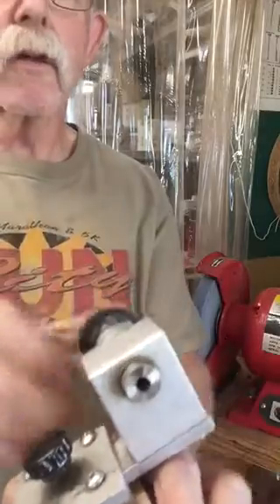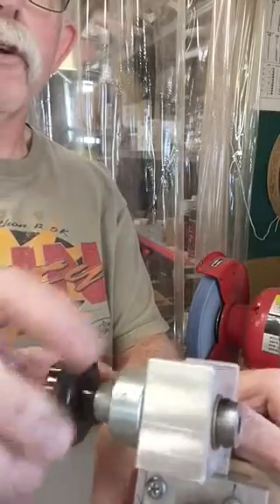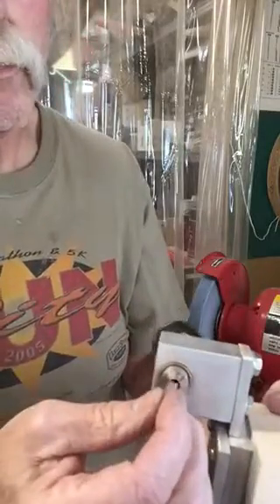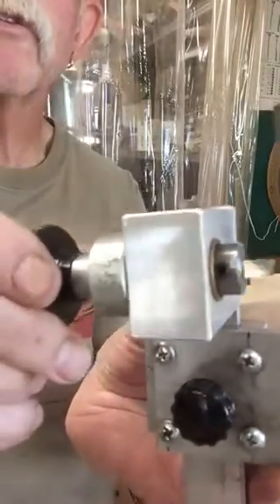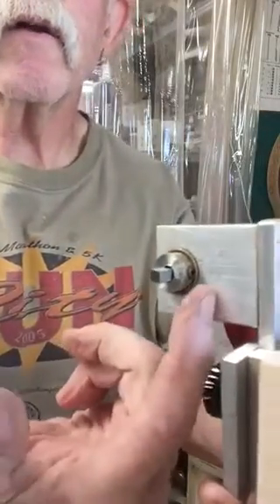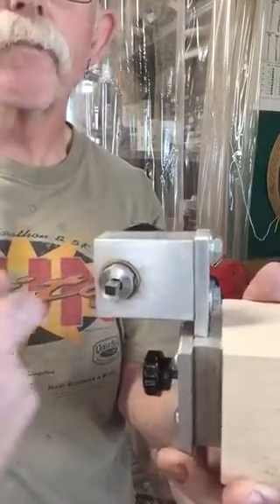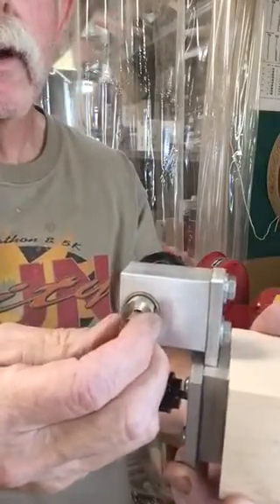This is the business end. It's an arbor that I can turn — it's actually in a bronze bushing held in place. On this end there's a hole; a piece of tool steel goes in that hole, and you can also see there's a set screw right there and another on the back side. I use those because I can also put smaller size tool steel — eighth inch — in there, and I use that to center the tool steel in the holder.